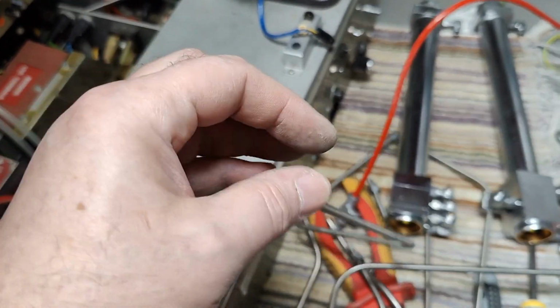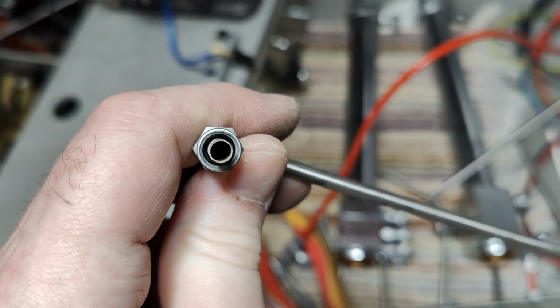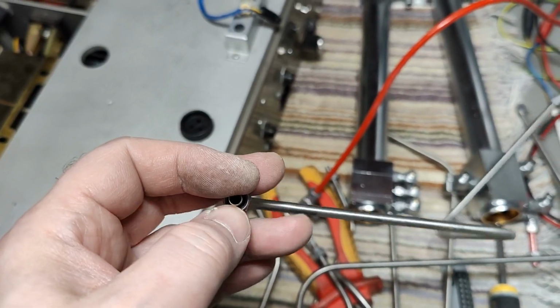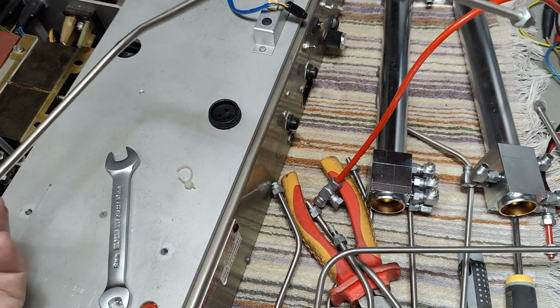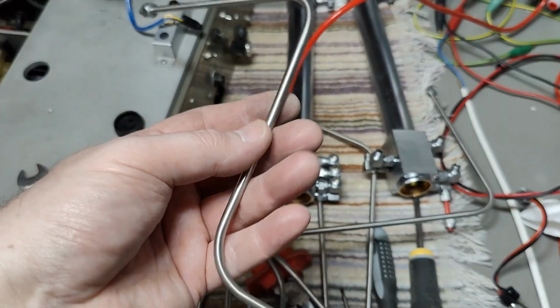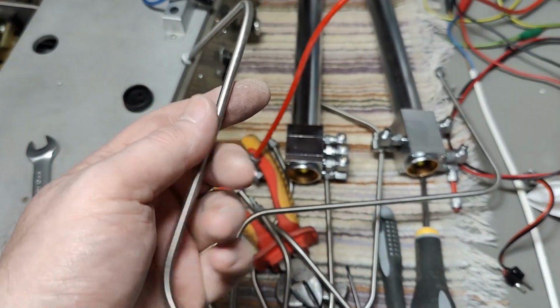It's just because, look at that. The wall here is thin as paper. And I bet that is because they want the highest possible inner diameter for whatever gases it is they're putting through this, right? But they are just light as air. This is so amazing. Obviously, they're most likely also quite fragile, so I try not to bend them.